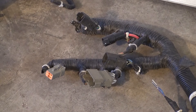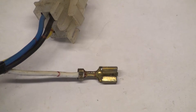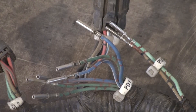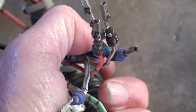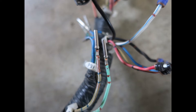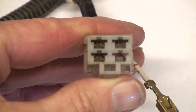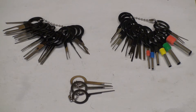As you can see here, there are multiple types of harness couplers being used. Each model of harness coupler uses its own type of wire connection terminal. Those wire terminal ends can be spade connectors, or round or square pin couplers. Even if the shape looks the same, the sizes can be different between manufacturers. The terminal ends can be open barrel or closed barrel and all are crimped to the wire. The inside of each coupler has some type of latch that snaps over a spot on the wire terminal and holds it in the harness. The coupler has provision to use some type of tool to pick the latch and be able to remove each wire from the coupler.